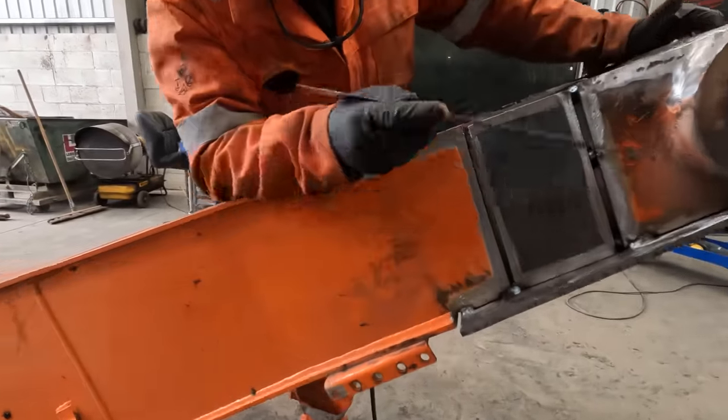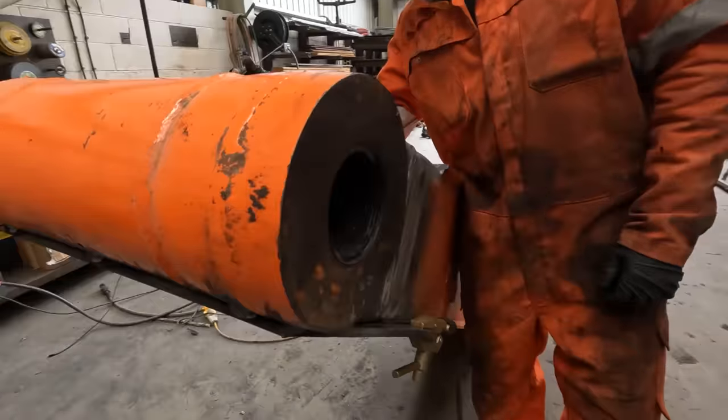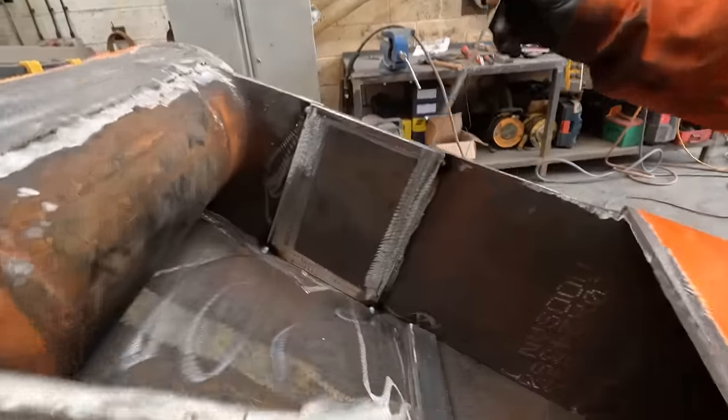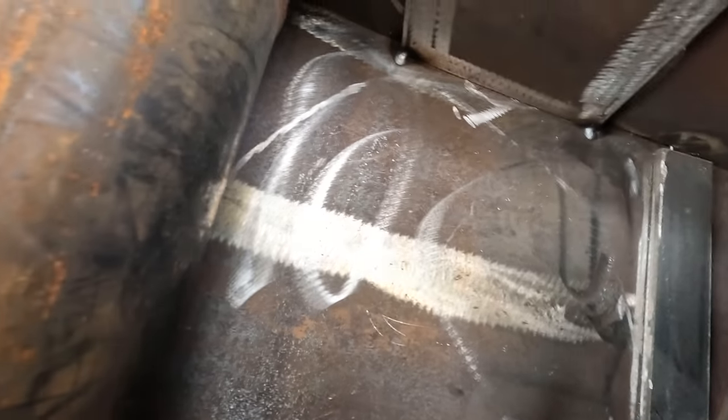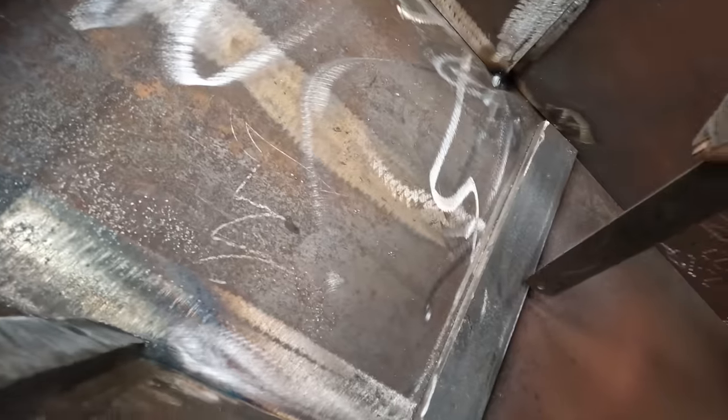Right, so we're getting there now, yeah. I put a backing plate on this one, bigger. Left an 8mm gap at each side of that plate, at that side. We're going to fully weld all the inside of this now, whereas there was no weld on it before. This backing plate here, I'll weld this. We'll weld under here. We'll fully weld everything and put a stiffener. I'm thinking about putting a stiffener down the centre here. Over that, I don't know, say, 100mm stiffener or something. And maybe even one that way, yeah. Just to give it that little bit more.